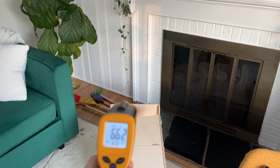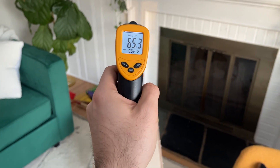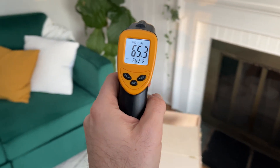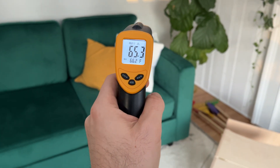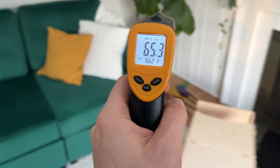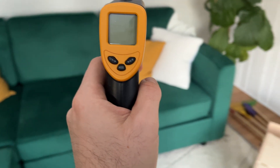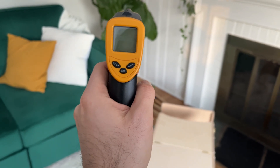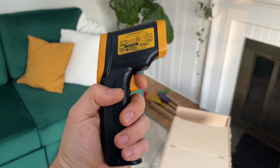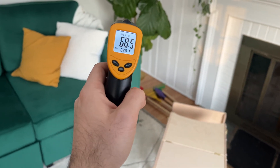I've used this a lot to trace around a window and help find drafts. That worked really well — I could see this spot is super cold, so I went around windows and doors to insulate that specific area. I've also used it to check outlets that face exterior walls. If something is a lot colder than it should be, it means air is coming in, which means I have to insulate the outlet. So I've used this a lot around the house. It's a really great household tool to help measure temperature in various spots.